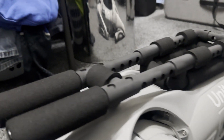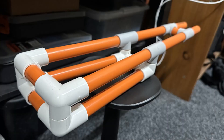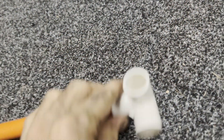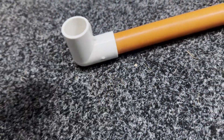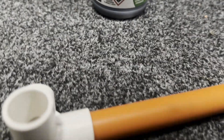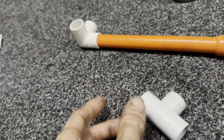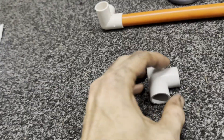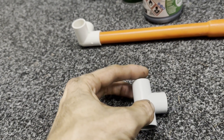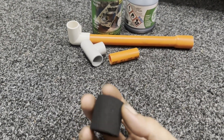It's just made out of 20mm conduit. You need six of these and you've got to grind them down. Use a hacksaw to cut them off. And four T-piece joiners — with two of these you'll have to do the same, grind them right down. This is just bicycle foam handlebar rubber.